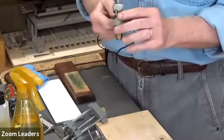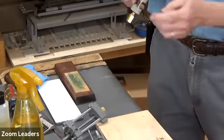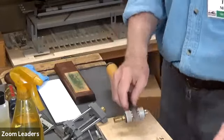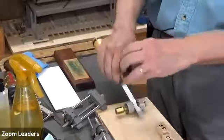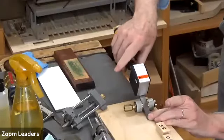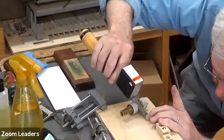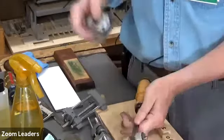One way you can do this is if you have a bevel, you can just look down like this and see that you're up a little bit. You've got about a hair underneath the back of the bevel and the front is touching it, and that will give you the micro bevel. Or you can use one of these and set the angle. You zero it here first, you get that and see where it is. And this is actually 30 degrees, which is not where I want it, but you could use it there. So extend it and see where that'll take you, and that's 24.6, and that's pretty close to where I'd want it. That's the bevel. I'd have to do something else to get a micro bevel on there, but that's how you can set both the bevel and a micro bevel with one of these